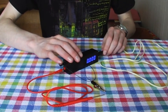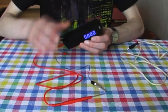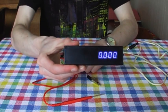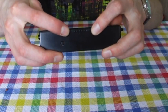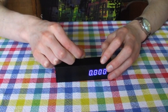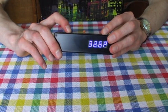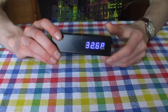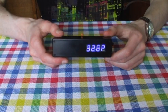This plug and socket approach extends to the other end of the unit, where I can unplug the standard logic probe style crocodile clips. This switches automatically to an internal battery, so I can use the logic probe without too many trailing wires. Battery-powered operation is especially useful when combined with this socket on top of the probe for testing components. I could have checked the capacitors in the circuit by inserting them here and using the probe's capacitance meter, which works by timing how long it takes to charge the capacitor via a 100k resistor — very handy for deciphering the peculiar markings on some capacitors. This one's reading 32.6pF, and it's a 33 picofarad capacitor, so that's close enough.